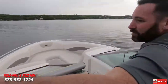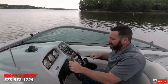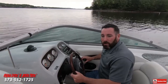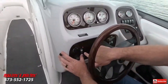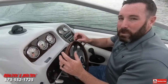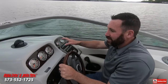Shut the windshield before we take off — it's just a habit. This fits nicely. If you always bow with your windshield open, eventually the windshield begins to bow against the window on the port side. I've had a lot of people who, excited to drive, accelerate with their finger on the trim-up button and the out-drive comes out of the water. You always want to listen — when it's up you hear it going up, when it goes all the way down it makes that screaming sound. The blower right here on the dash ventilates the engine compartment. Bilge pump is automatic so you'll probably never use that. When we get this boat off the water I'm going to send it in to detail, and when it's done I'll come back and show you that all this stuff works.